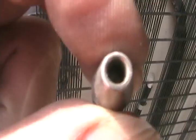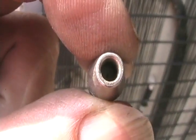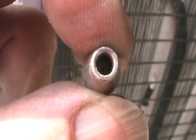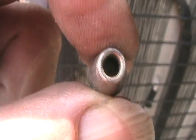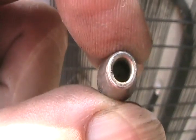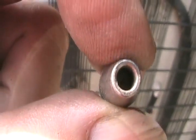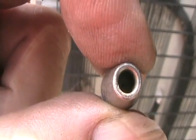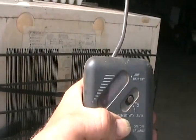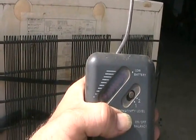I've unscrewed the tip — inside there looks like the prick of a pin, and there's a high-voltage corona in there. If you look at it in the dark when it's turned on, a few thousand volts is trying to make a little spark that jumps, but it can't jump — the distance is too great. When Freon gets in there, the molecules become charged, the resistance changes, and the machine measures the resistance. As you get more and more Freon in there, more red lights turn on and it starts ticking faster, like a Geiger counter.